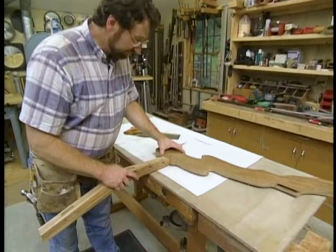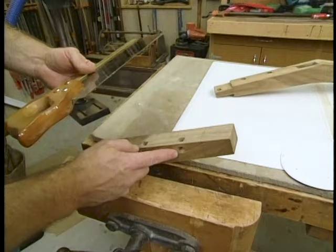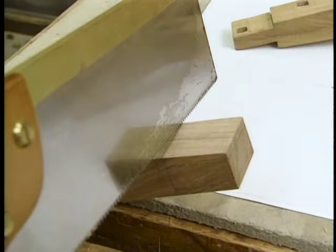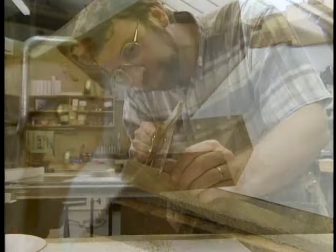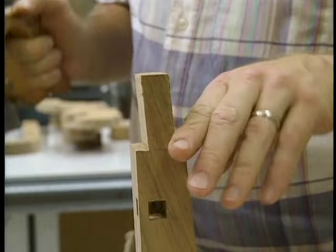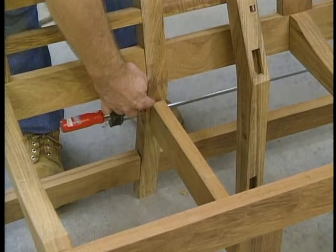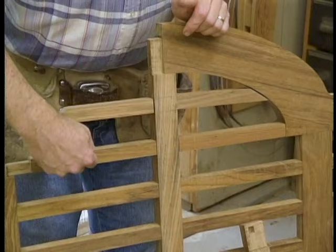The legs are connected to the decorative backrest with tenons. It's easier to cut those tenons by hand using a backsaw, so I've mounted the leg with the layout complete and the first thing I'll do is make this shoulder cut. The techniques for making the center leg are the same as the end legs, but there are a couple of differences: the mortise for the cross stretcher is a little bit higher, there are four extra mortises for back slats, and of course this top tenon is a little bit longer.